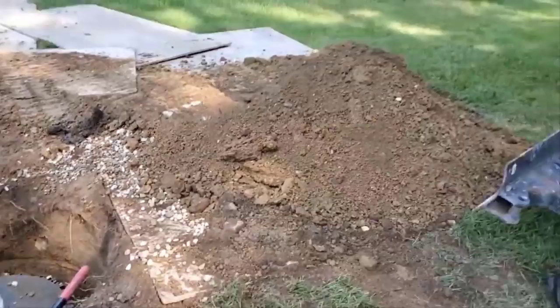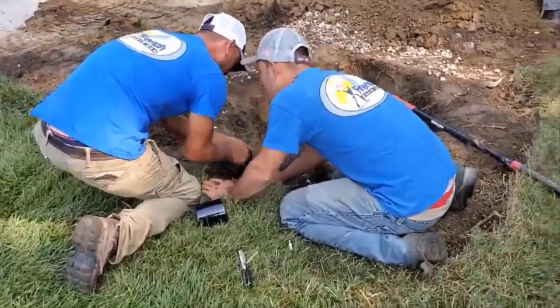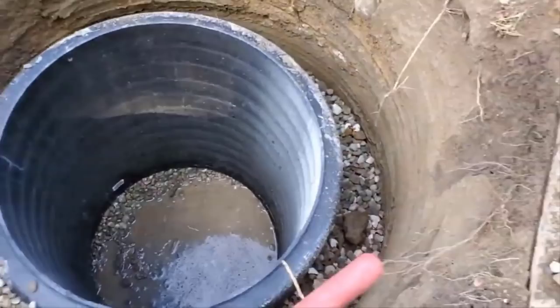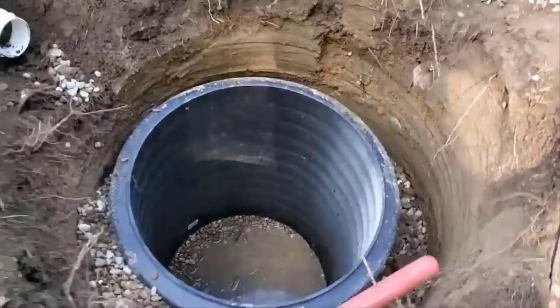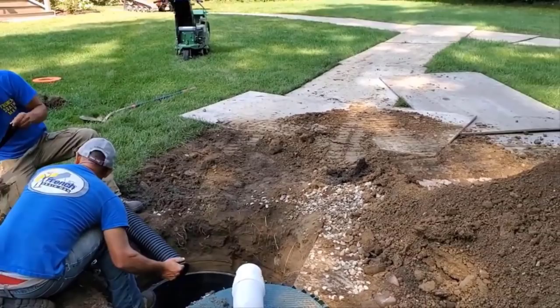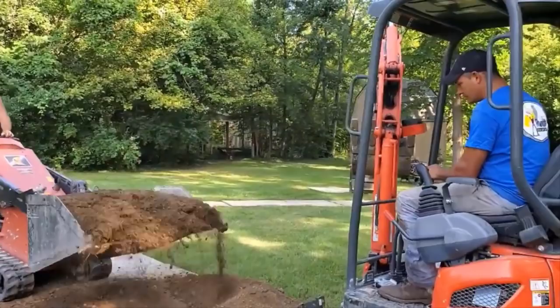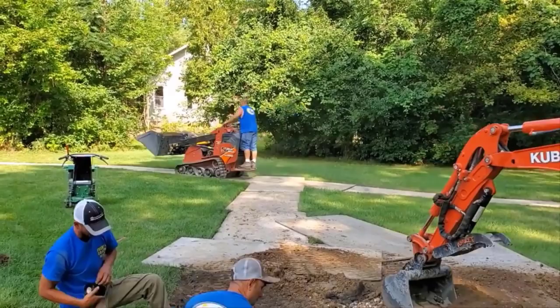When a sump pump discharge line goes on, you have gallons of water. And during a rain event, you'll have hundreds of gallons. And you can't ask the small area where it's discharging to take in all that water. So we have a vertical dry well, 24-inch crock right there. We have a bunch of drainage stone around it. And that dry well has half-inch and 3/4-inch holes drilled. The water is going to slowly run into the gravel and into the subsoil. During really hard rain events, it's going to end up in the five fingers in the leach field.